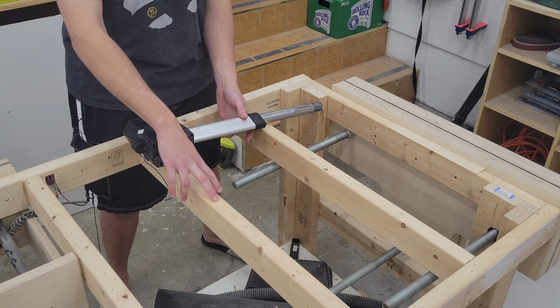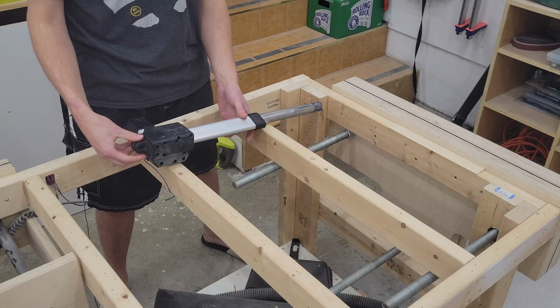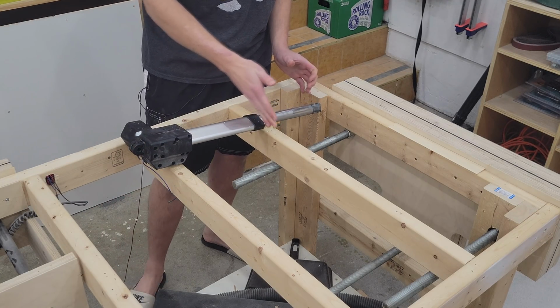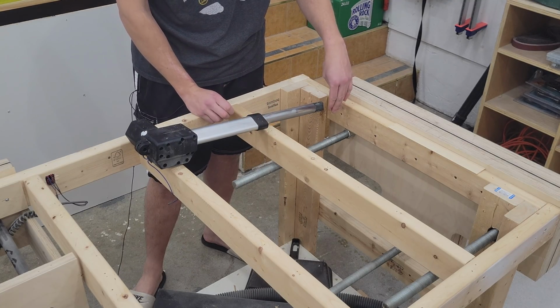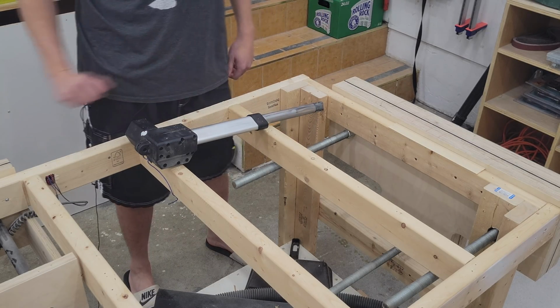This joist, however, is going to be interfering, so we'll have to unscrew it and move it down to the back side, where I'll drill a clearance hole for this nub to sit in. And with those two holes, this will be totally locked in place and can't go anywhere. The clamping is going to happen between this shoulder pressing up against this joist and the pin over here. Because of that, I'm going to go ahead and put a brace between here and here, just a simple 2x4 brace. Let's go ahead and get those few things done.